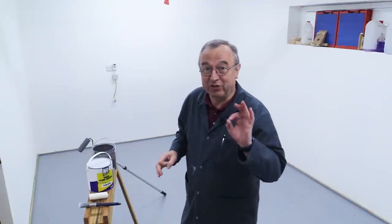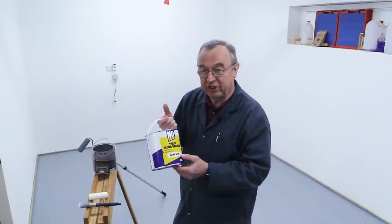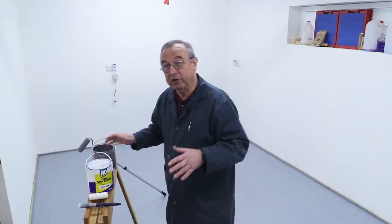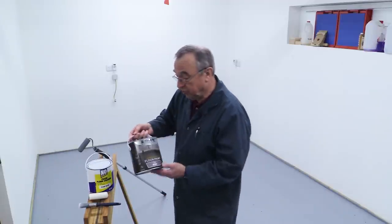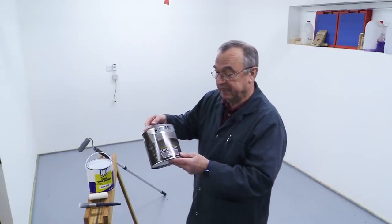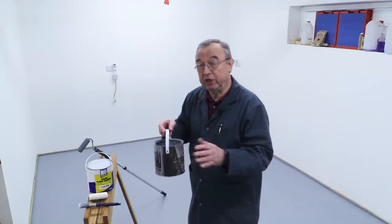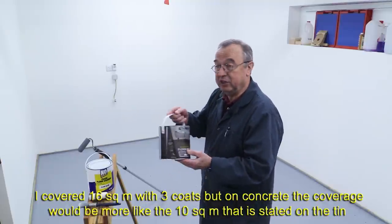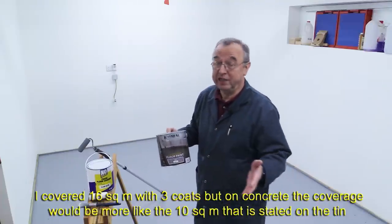Well, that's it, or at least that's this stage done. I'll talk more about the next stage shortly. I'll just remind you, I used this cheap and cheerful clear satin varnish from Screwfix. It's water-based, and I applied several coats of that to the chipboard floor first, and then after that I used this Ron Seal diamond hard satin floor paint, and this is slate. And this did three coats. I think I may have mentioned this is about 16 square meters here, and this did exactly three coats. I have none left, and I just managed it to the end, and I'm really happy.